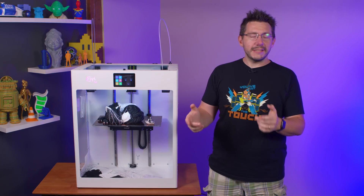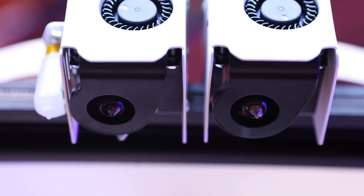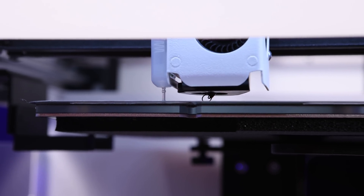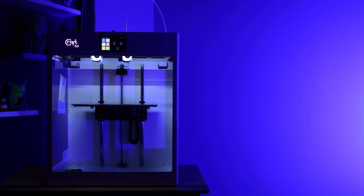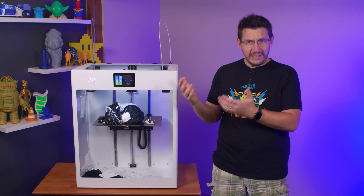Let's get technical, let's dive deep, right here on 3D Printing Nerd. The CraftBot Flow Idex XL is an impressive machine on paper: independent dual extruders with nozzles that'll each go to 300°C, automatic mesh bed leveling, and nozzle calibration. Build volume is 450 on the X, 250 on the Y, and 500 on the Z, with the option of being fully enclosed. There's a Raspberry Pi that powers it all, and they've got a warranty of 5,000 hours or 5 years.